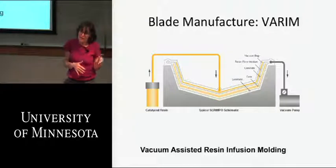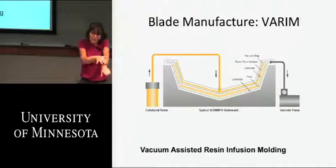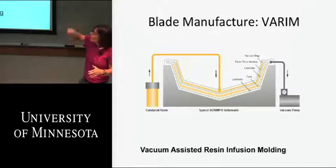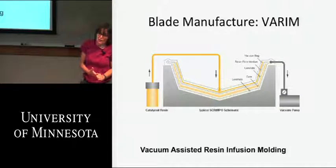And a lot of times the way they'll do that is they're not going to have unidirectional fibers, so it's not like super optimal, but what they'll do is they'll make a weave. So they're using the same technology they use to weave fabrics, socks, anything like that. So they have a weave that creates what's called a preform. And that preform has kind of preferential direction of fiber orientation. They'll put that in there, and then they'll just inject the resin through. And it happens very quickly.